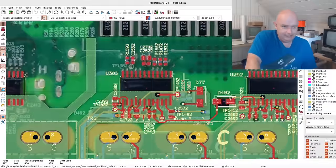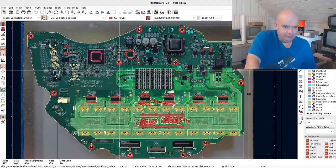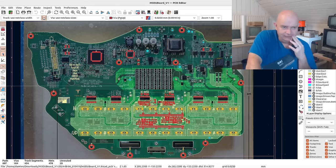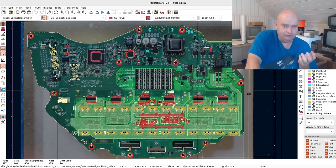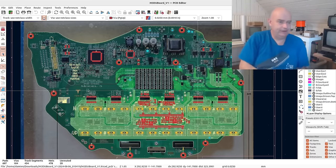For those looking at the board — from the midway point down would be pretty much duplicating the Tesla gate drivers and the current sensor connections and probably some stuff around the discharge system. But that will be where we break away from the Tesla system on this board.